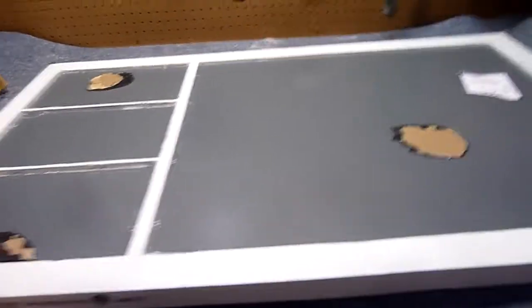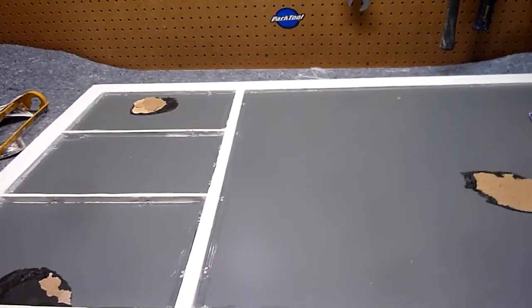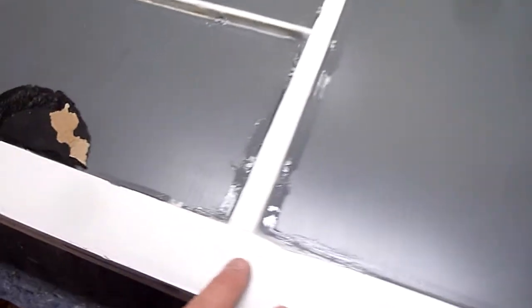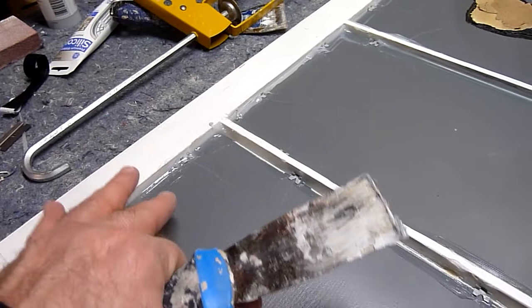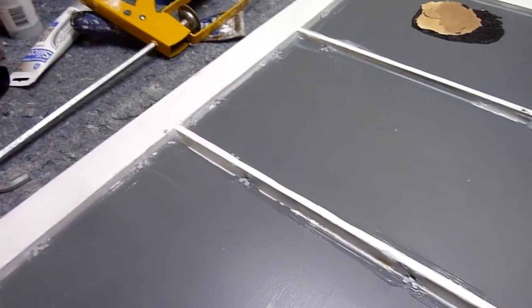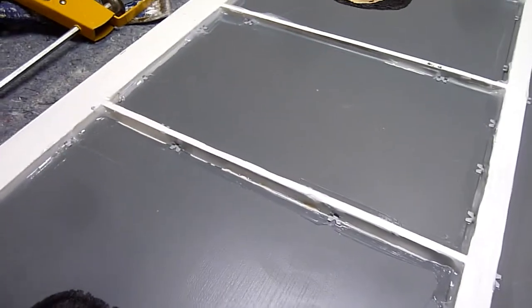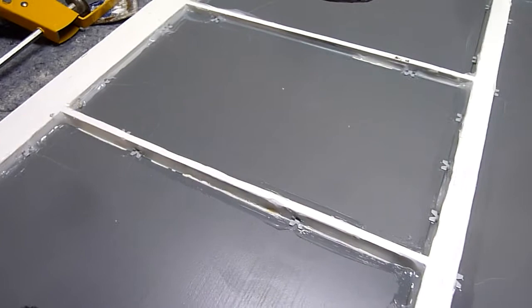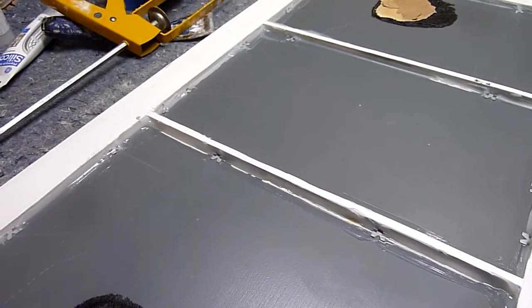Here's the back of the picture frame. I just want to show you how I did the installation. I'm not any sort of a professional at this by any means, but I did do a little research and found something that worked for this application. What you want to do with the frame is clean it up really well in the corners before you put the glass or mirror in, because you want it to lay nice and flat. Because you're seeing a reflection on the corners and edges on the other side, anything that's not flush is going to show. You also want to make sure it's painted a consistent color — I made sure it was painted white, same as the other side of the frame — and then just had these pieces of mirror cut to fit.